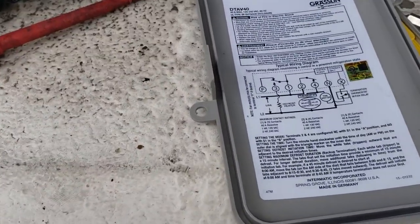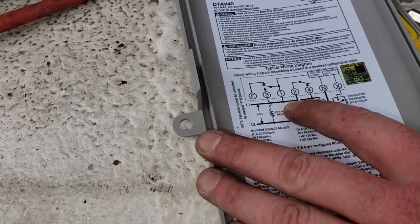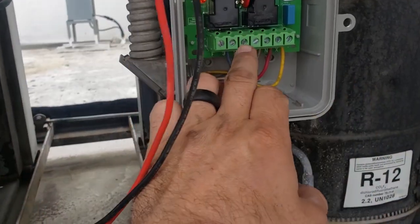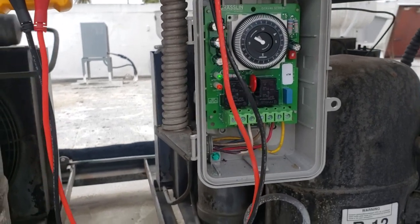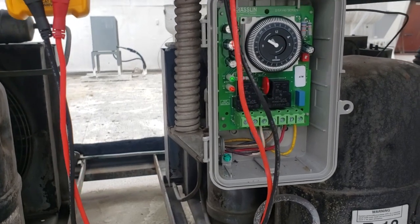Show me that on here. The whole top needs to have a jumper between 1 and 2. Okay. But that line doesn't exist here in that car. That's right. So we're missing our jumper that's acting as our common for the switch leg for the refrigeration circuit. So we need to go ahead and power down, put that jumper between there, and then power it back up.